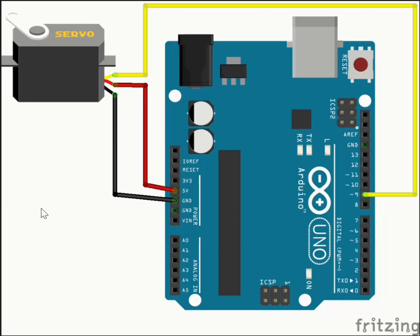In this project, we are going to use an Arduino Uno, a PS3 joystick, and a servo motor. Now, a Python program running on the computer is going to read the value of the potentiometer on the joystick, and it's going to convert it into an angular position in degrees that is going to command the servo motor. So the Python program, after reading the value of the potentiometer, converts it into angular displacement and sends it through UART into the Arduino Uno. And the Arduino Uno is going to control the servo motor into the corresponding angular position.